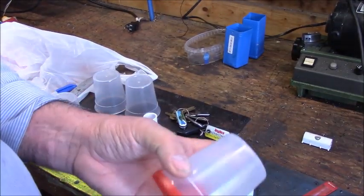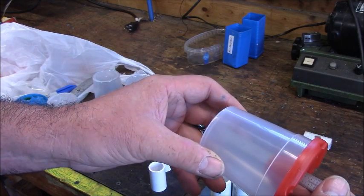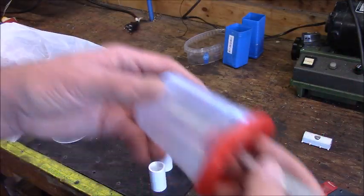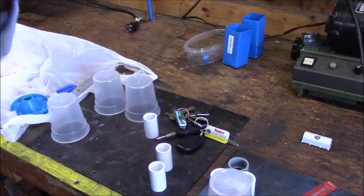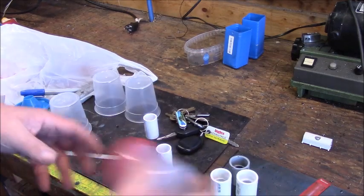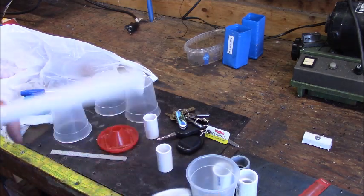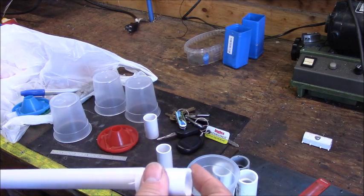You want your stem to come up about an inch off the bottom. Basically we're looking at approximately two and a quarter, two and an eighth inches or so. Yeah, approximately two and a quarter - that's to the bottom of this. If you're using the larger cups, the ones that have bigger bores where the pipe will slide through, this depends on the paint cup that you get. What I would do in that case is take these fittings over to the lathe, cut them about half in two. These are just standard fittings and I would just glue them on there just like this.